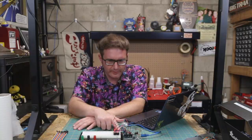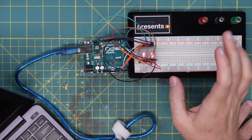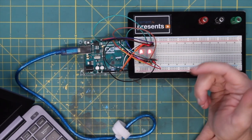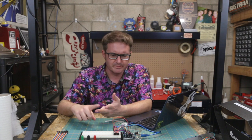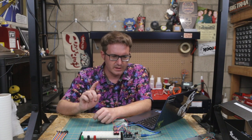Take a look at this wiring — this is an Arduino Uno, so I've got 20 pins to work with, and I'm using 17 of them — 18 plugged in but one is a no-connection. There's got to be a more efficient way to do this, because I still need pins for the RTC and the screen. That's where my LED driver IC comes in handy, so let's start looking at that.